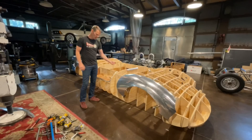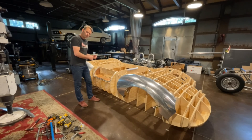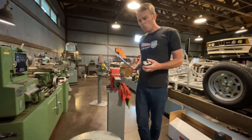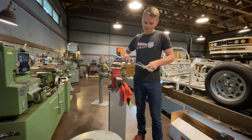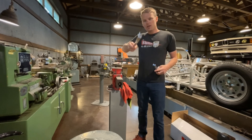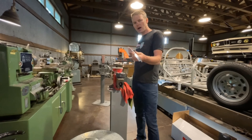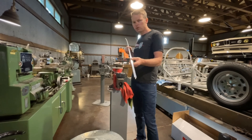This will give me a solid line to mark out my door opening and also give me the ability to actually hammer the door flange or door opening right over the buck. I'm working with half-inch aluminum channel — half by half, and it is one-eighth inch thick. This is just stock that you can get at a local hardware store. When I buy this, it is in an H14 state, so it's pretty rigid.